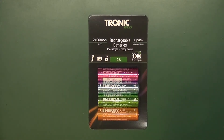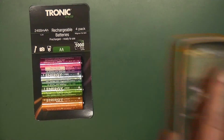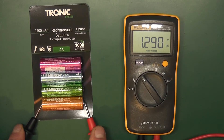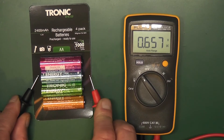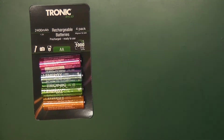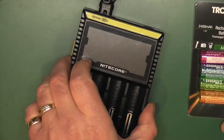I forgot to mention it also said they come pre-charged and ready to use. Let's just check it out. I'll just move those to one side, get the meter and check them now. Readings are 1.290, 1.290, 1.288 — slightly off — and 1.295, so they're reading slightly different. What we'll do is put them onto a charge, charge them all up, and then we'll do a discharge.